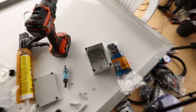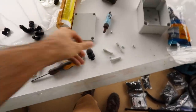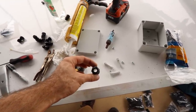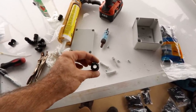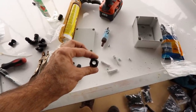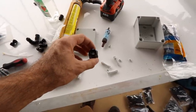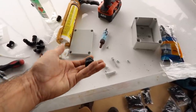All right. So we've got a solution. So this is our box. We're going to use this cable gland. So this is a 5mm to 10mm cable gland. What we're going to do is put four 6mm tinned cables through. I know that sounds dodgy, but we don't really have any other option in terms of being able to fit this. So we're going to put four going through in one cable gland so that it's quite tight. And we're also going to fill it up with a sikaflex adhesive inside it, and then we're going to clamp it all shut. So it sounds a bit rough, but it's as good as we can possibly get given the lack of room that we have to work with.